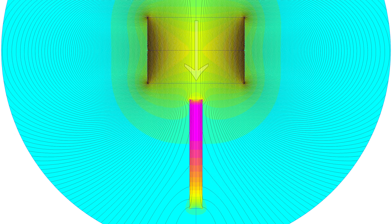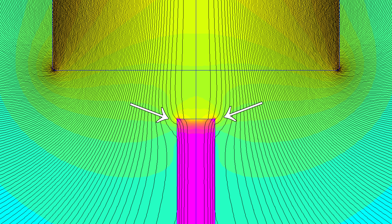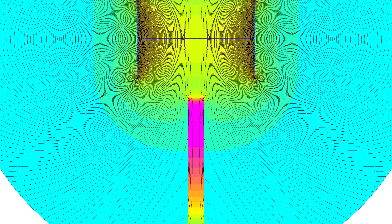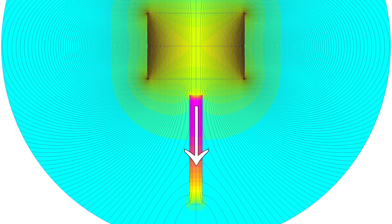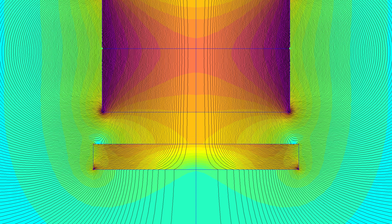This appears to be the explanation. When upright on the center, the weight is aligned with the almost straight and parallel magnetic field lines coming from the magnet, and the magnetic field lines even cluster together in the weight since it is better at conducting a magnetic field than air. In technical terms, the ferromagnetic weight has higher magnetic permeability than air. With a lot of parallel long field lines going all the way through, the induced magnetism in the weight is very strong. All the magnetic domains in the weight are more or less aligned to form a classic dipole bar magnet. In the other, almost impossible scenario, the magnetic domains inside the weight are not teaming up to form a magnetic field with a uniform direction. The field lines are curving away from each other — many field lines are leaking out at both the bottom and the two sides. The weight is weakly magnetized without two clearly separated poles. It is a mess.